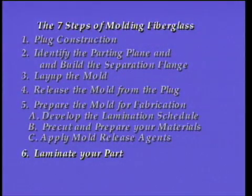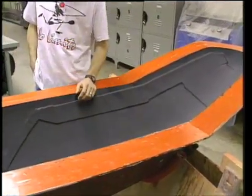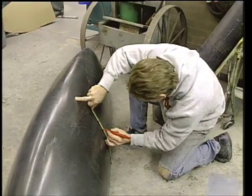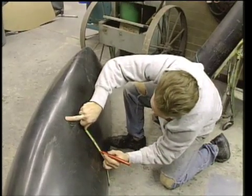We are ready to begin the sixth step of molding, which is to laminate your part. The top shell was not as complex as the lower shell. As you can see from the outlines, the honeycomb was placed in strategic strips for structural support. Because these strips would only have a single layer of graphite and resin on top, we decided to vacuum bag the lamination in one portion. After the shell was released from the mold, the honeycomb strips could not be seen from the top. The surface was smooth and the top shell was complete. There were additional secondary operations to perform, which we will show you at the conclusion of this video.